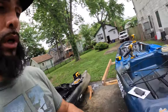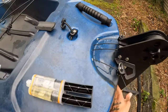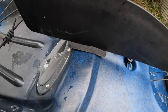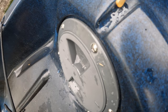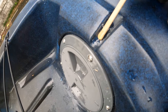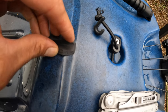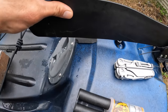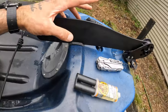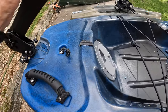This last mod is probably the easiest one. I am going to apply just a little bit of foam right here to this notch in the hull where the rudder comes down, so there's not a huge bang when the rudder lands against the hull. I've got some Gorilla Epoxy clear that I am applying to this notch. I did use some sandpaper just to scuff up the hull a little bit so the epoxy will bond better. I place my foam directly in that notch. Now it's got to sit for 24 hours, so I'm going to flip the rudder over onto the foam and put a brick on the back of the rudder to hold it down overnight. My foam piece did set overnight — no doubt that's going to work. You can see that is quite a bit more quiet than the rudder coming down and banging against the hull.